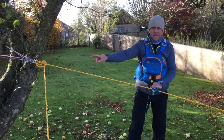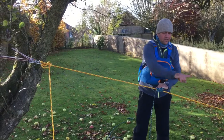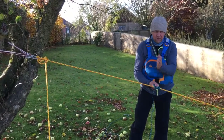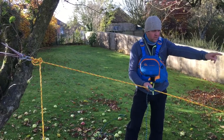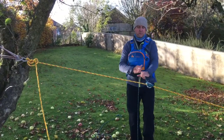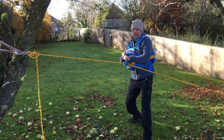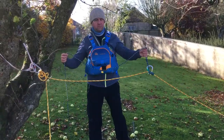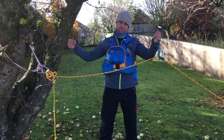you're probably going to get 1.5 to 2 factors going either direction. So in other words, I put force in here, that force is magnified and multiplied onto the boat so I can get more pull on it. So I can vector pull the boat out. And I've done all that using three carabiners and a bit of cordage.